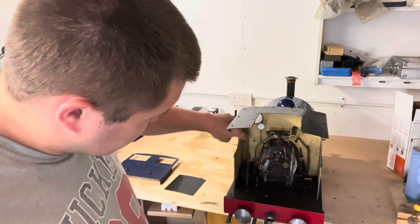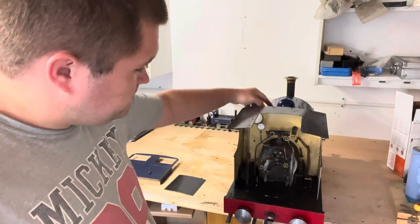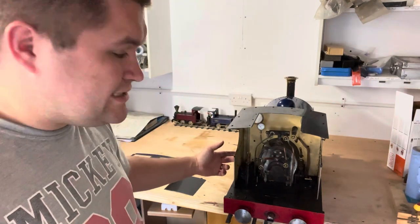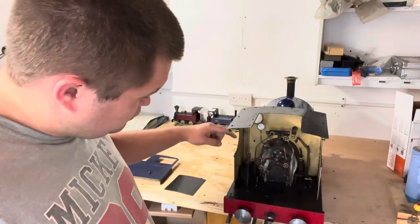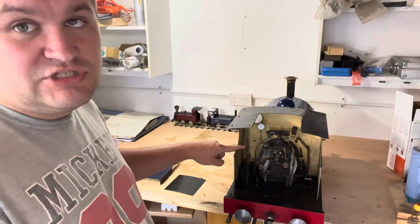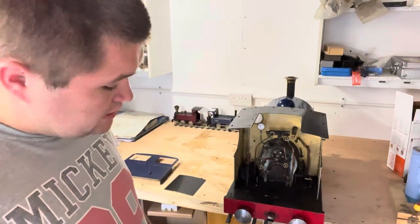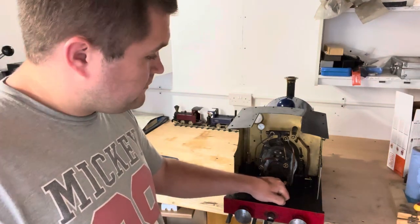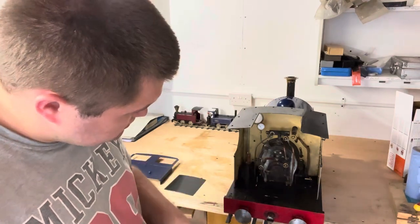Because it comes via this sight glass, so I can see this sight glass is the tank level, but off the bottom of it, just because it's a convenient place to connect it, is where the hand pump feeds from. So yes, while you're hand pumping, it looks like you've got an empty tank because it just goes. But the injector clack is this one, bottom right. Which is, again, you can see they're both brass.